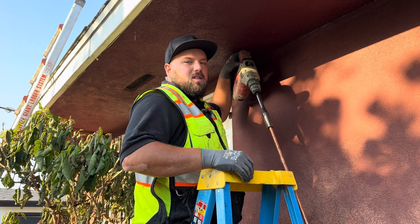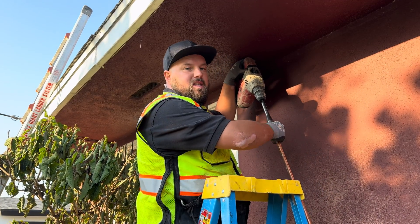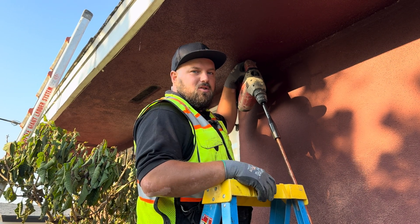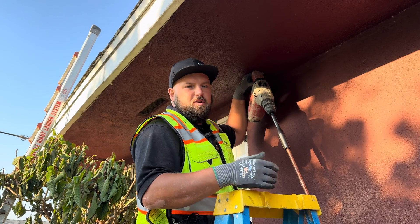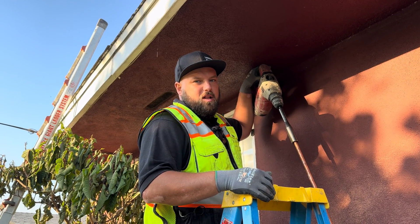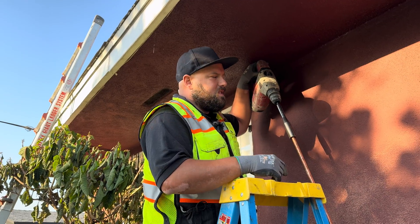The first thing we like to do is get our ground rods in the ground right away. If the rotohammer won't get it in and we can't beat it in, we use our 60-pound jackhammer. But if the utility company has already shown up and turned all the power off, we can't use that one unless we grab a generator — so we're going to drive this thing in the ground.